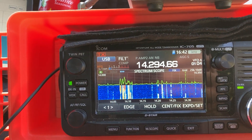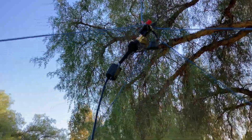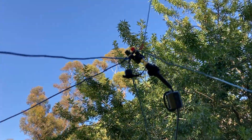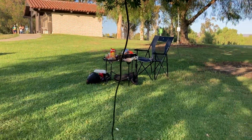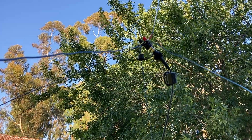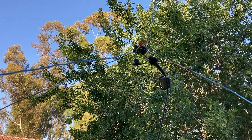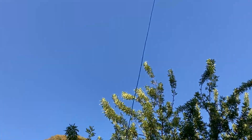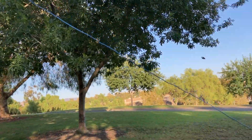Sometimes you have to adjust it a little. If the radials aren't as high — I've done experiments with this — you'll see the SWR dip, the most resonant point, shifts more to the left on the graph, meaning the antenna is acting longer and you'd need to shorten it. What I think happens is: as the feedpoint goes lower and the radials droop, the antenna feels electrically longer.